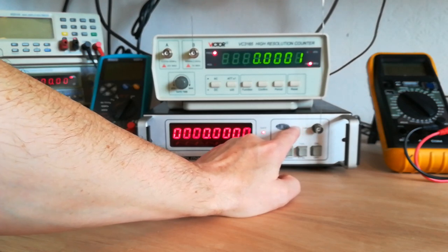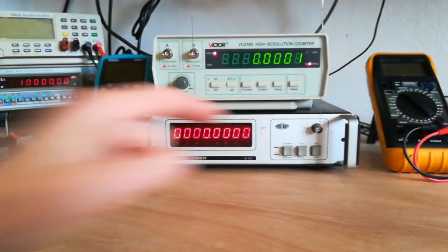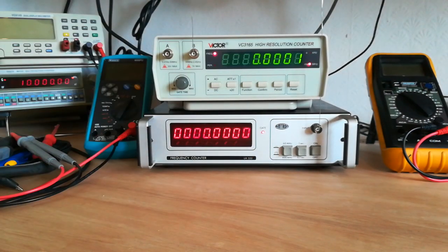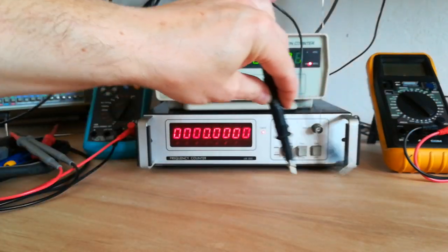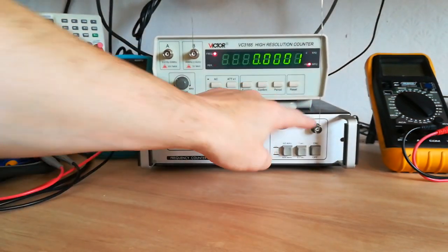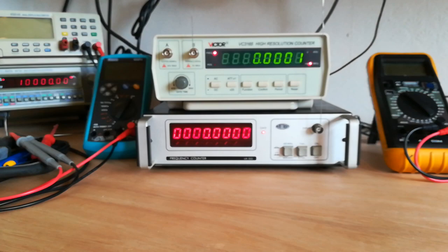The reason for that is to put one of these cheap eBay preamplifiers. It runs from basically 1 MHz to 2,000 MHz and just boosts the input, which is what this could do with. It's fine if you're using it as a probe to probe a frequency — great for that, no problem. But if you're using it as a sniffer, then it doesn't work quite so well.